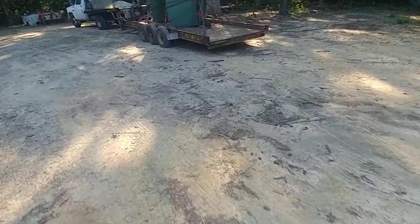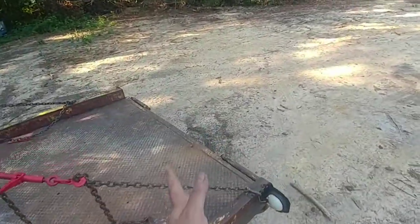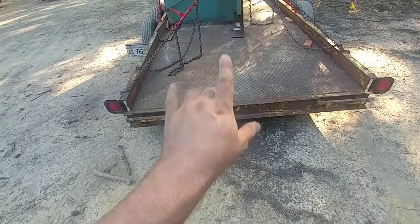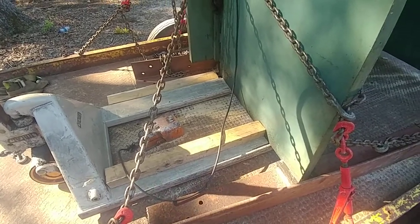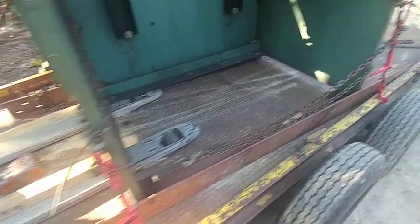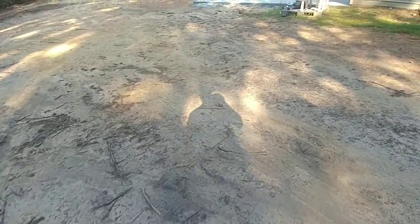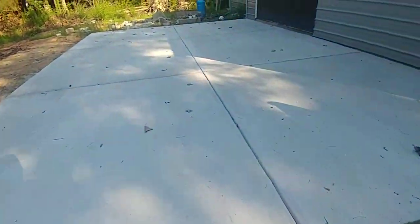So, you know, once I get the edge of the machine, so this edge of the machine to the back of the trailer, I'll have 1.5 feet or so of these sticking off. And then I can bridge across a pallet jack, pick up that part, and just slowly edge it back until I then get, you know, say that much on the trailer. So then that gives me a surface here that I can jack up to, barely pick it up above the trailer, pull the trailer out from under it, and then block it down. Once I get it blocked down, use pallet jacks and whatever else I need to move it over here.